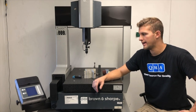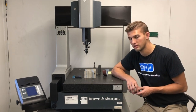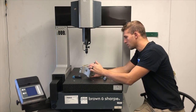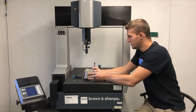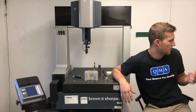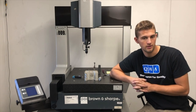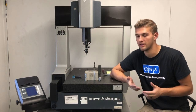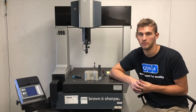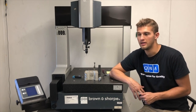Now we're in our inspection room. In here we've got our CMM — this is a very useful tool when you're trying to hold those really tight tolerances, whether you're doing medical parts or aerospace parts. You're able to pick out a feature like a circle, take the probe, go around it, hit about 10 to 15 points, and it gives you a really accurate overall measurement. We've also got our height gauge, our hardness tester, and our optical comparator as well to measure different radii and features. We're required to have a room like this because we're ISO certified. For anyone that's not ISO certified, I would highly recommend it — you're able to get into more medical companies, robotics companies, people that want you filling out inspection sheets. There's a lot of paperwork that goes with it, but it's very worth it.